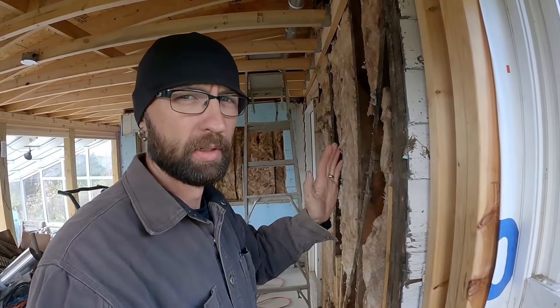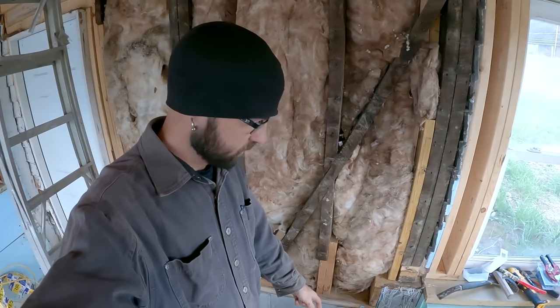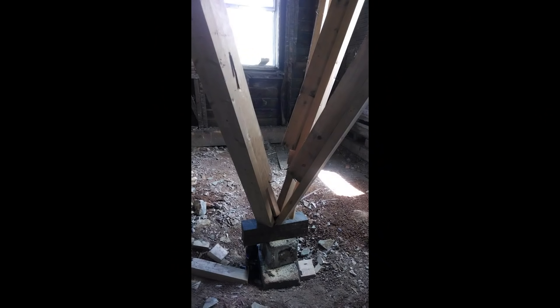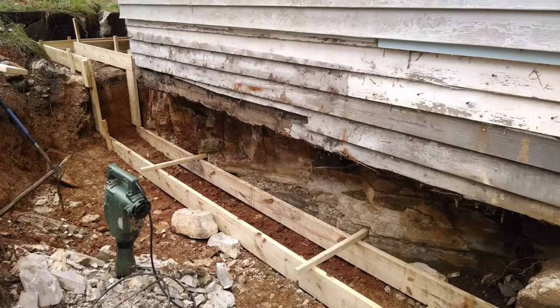This wall is kind of the same way — it's actually bowed really badly. Again, this is the original exterior of the house; you can tell by the makeup of the lumber. This section is actually part of the house that I had to lift up off the ground and put a foundation underneath, because it didn't have anything. That was a really fun process — I use 'fun' loosely. I built a structure, pushed the ceiling up holding the entire structure in the air, then came along with a chainsaw and cut the bottom half of the house off.